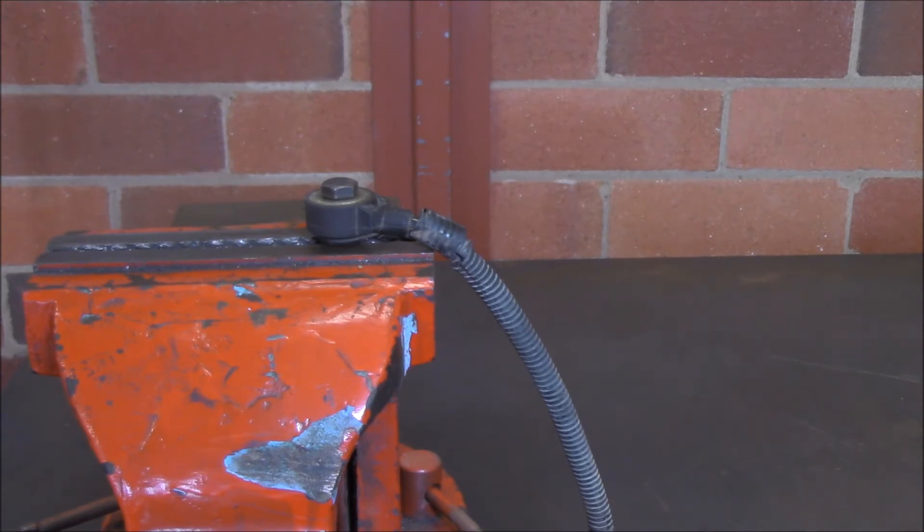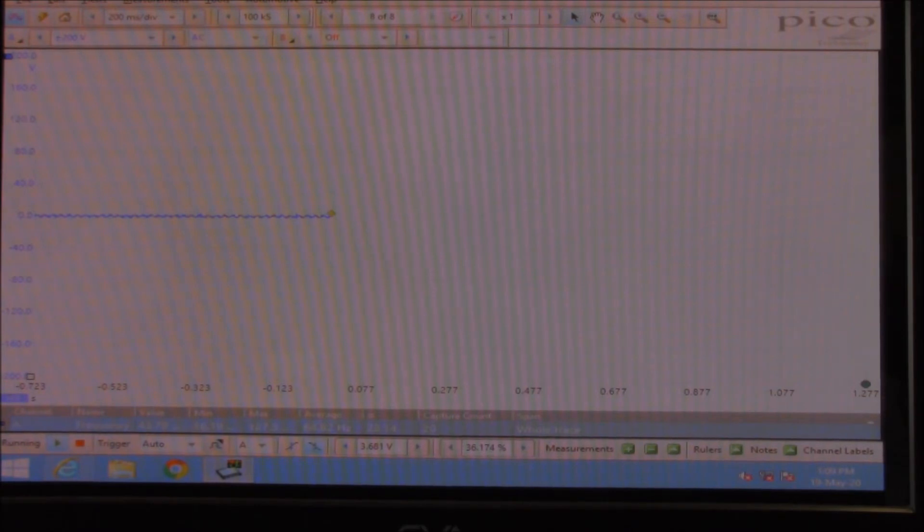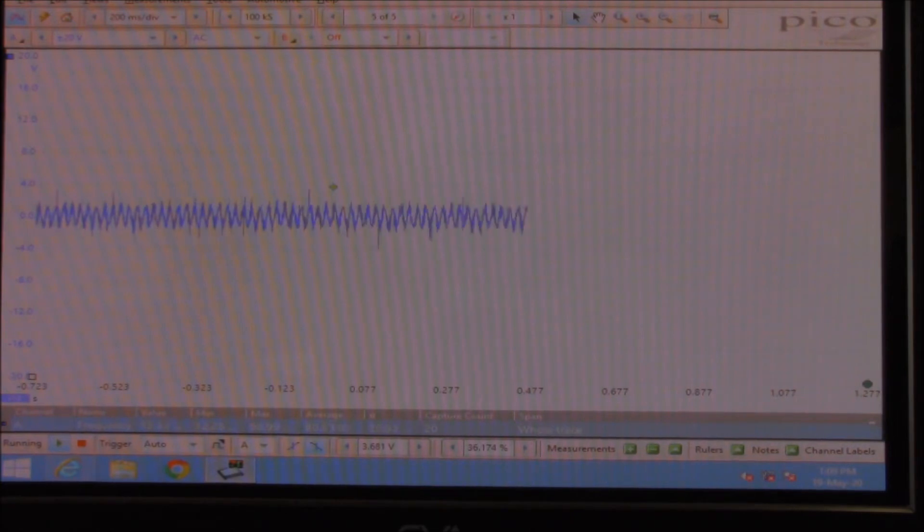Let's have a look at this resonant sensor. The frequency is showing about 60 hertz — that's from me talking, which is typical for a human voice. I'm just going to start tapping it very lightly. See, it's not picking up anything. But if I give it a decent whack it's just as sensitive as the other one. If I tap it with my nails there's nothing happening whatsoever — it's not picking up the right frequency. Even at plus or minus 20 volts, there's not enough signal from light tapping to register. This sensor needs a decent whack or the correct resonance frequency before it will start to register.